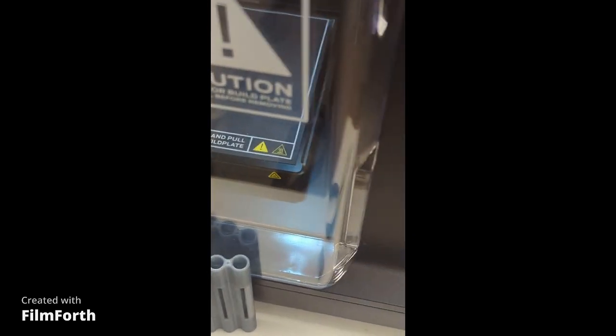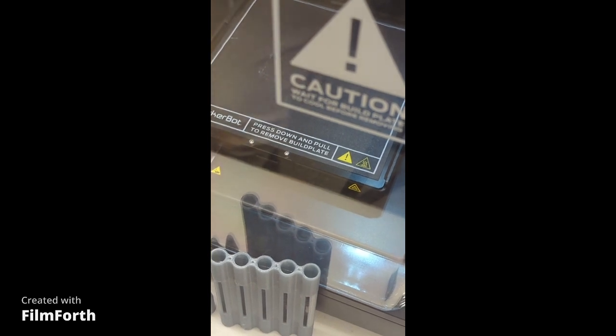These are all printed into one array overnight and it did fantastic — I love it. Once it cooled down you can actually remove the plate, which is this guy right here. Once it cools down, remove it, and now you can just do a flex so it'll come off easily while it's cold. Do not take it out while it's still warm, and do not bend it because it will flex since it's still hot. Once you leave it to cool down you'll be okay. You can actually replace the bed — put this aside on a table, let it cool down, put a new bed inside, and that'll be your next print. You can use those replacement beds in your box so the other one cools down while you keep printing — like a vice versa of endless printing.